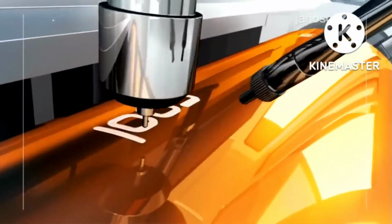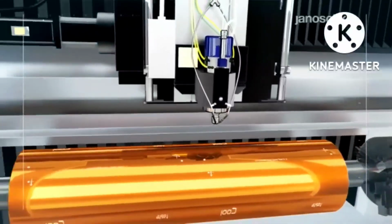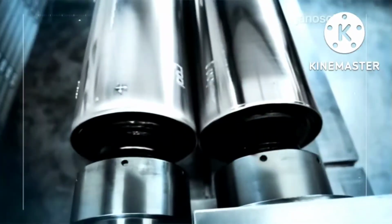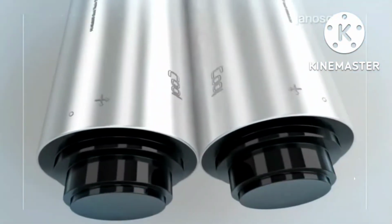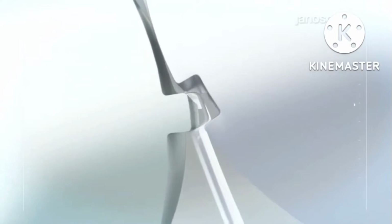Hand in hand with the customer, Janauschka's intensive new product development services provide outstanding and impressive options for the print finishing. Usually, 2 embossing rollers, called the female and male mold, are necessary to emboss the design. The required accuracy of the embossing rollers is finally checked and confirmed by embossing the cylinders onto the original substrate.